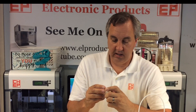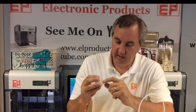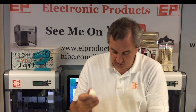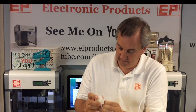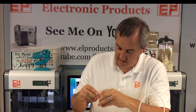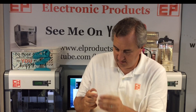And here it is. I took it out of the printer — it's got some support material on the bottom to break away, but the threads look really good. So I have to try this on the hose. I'm going to break away the support material and see how well it breaks away on PLA. It's a little bit tougher than ABS, but it's breaking away. It's almost like breaking away glass, it's so brittle.